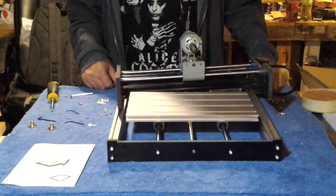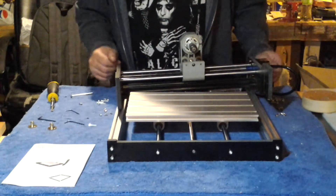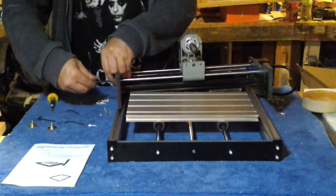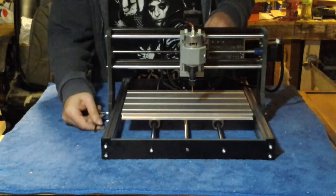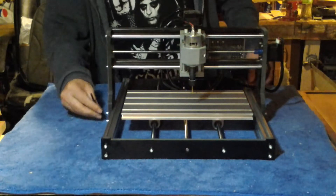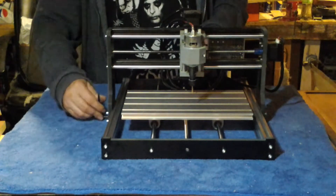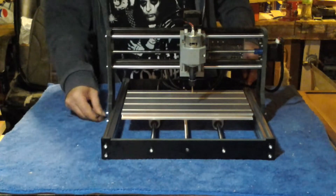When we originally assembled our machine, the two side pieces for the gantry were put on separately, so I'm going to remove my right side — the one without the stepper motor — and reassemble it again according to the original instructions. I'm not going to bother centering the gantry at this point since I don't have a new spoil board yet to take advantage of the full size of the Y-axis. I also reapplied loctite to the set screws on the connector for the lead screw on the stepper motor.